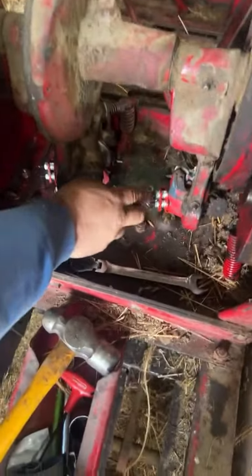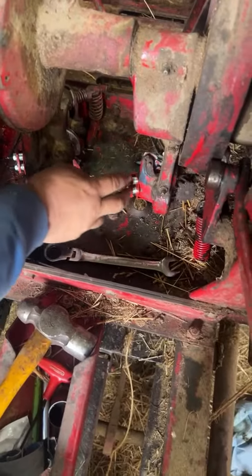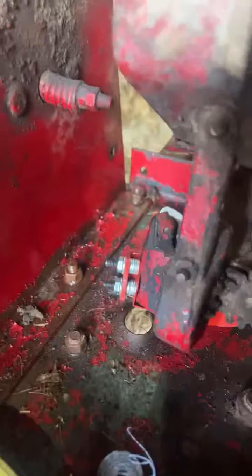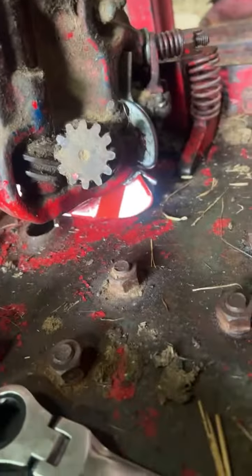We're going to assume that we got the shimming correct. Because we have the stud kit, you can remove the nuts and change your shims to make your knife cut sooner, or take a shim out to make it cut later. So if it cuts too soon, you'll get a sloppy knot and it looks like it didn't even try to tie it — that's because it cut before the billhook started to tie it. So there is a fine line on the adjustment on that knife.